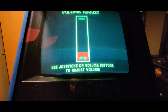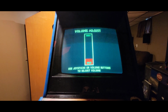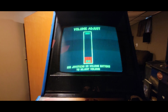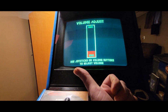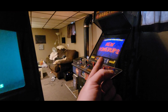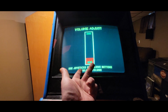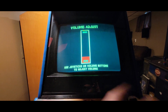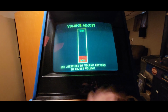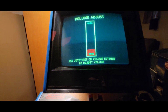Wow, okay. So maybe I cured it for now, but I don't trust it. I mean, like I said, I got that power supply literally cranked, and it should not be like that. I don't have to do that with my bench power supply. I don't have to crank my bench power supply when I have a Midway board, like an NBA Jam TE, or Maximum Hang Time, or an MK1, an MK2, an MK3. None of the newer Midway boards like Cruisin', Off-Road Challenge, none of that. I don't have any issue with this on that. But this, for some reason, does.